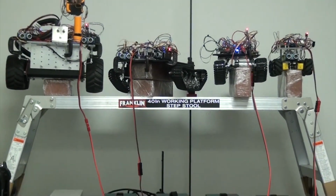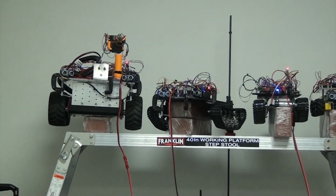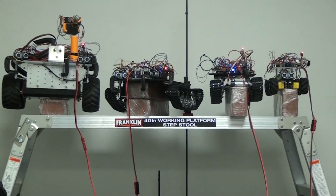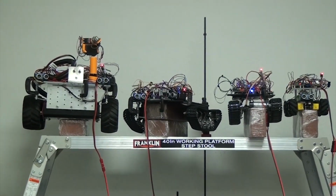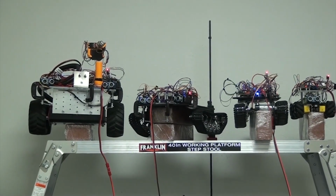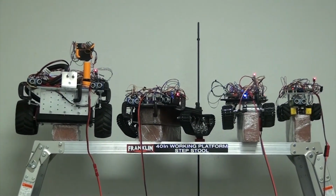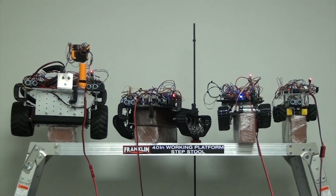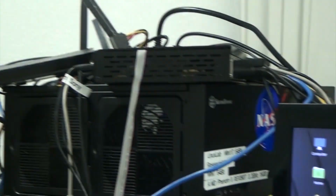This means that there's no connection to the Networked Robots platform, in this case the frontline server. So the frontline server is going to access a database table and then make a connection to each individual robot. So the database table has basically the 48-bit MAC address of each robot and its associated IP and port number, plus other information about the robot. So those are all stored in a nice table in a database implemented in MySQL on the Linux server here.